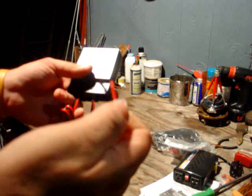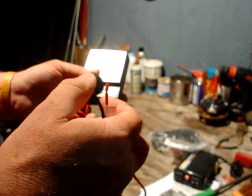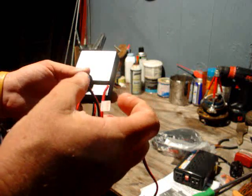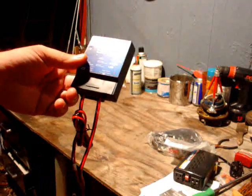The electrons are negative — that is your supply. When you disconnect, disconnect your negative first, then your positive. So hooking up: positive then negative. Disconnecting: negative then positive. Always remember that on all units. Turn things off before you start working with it.